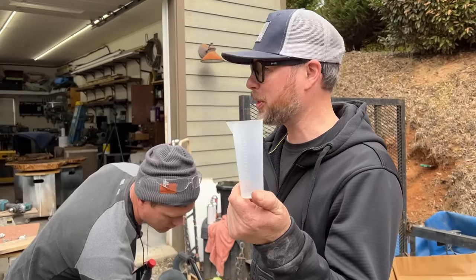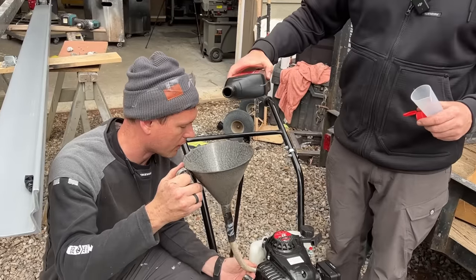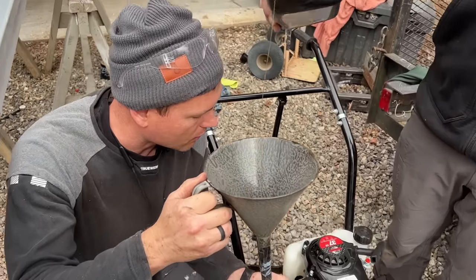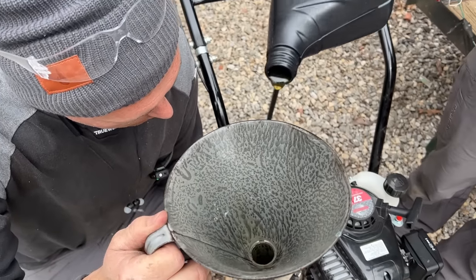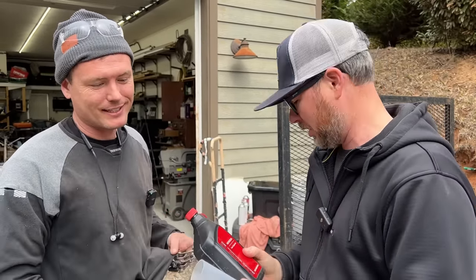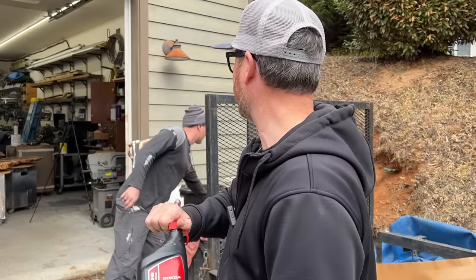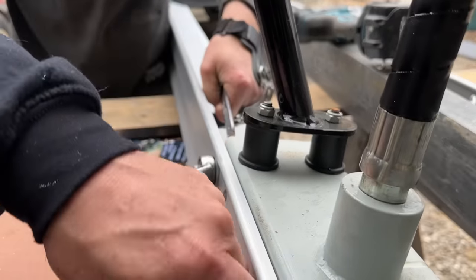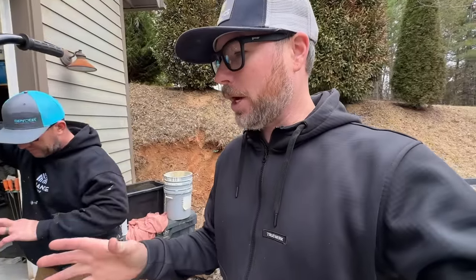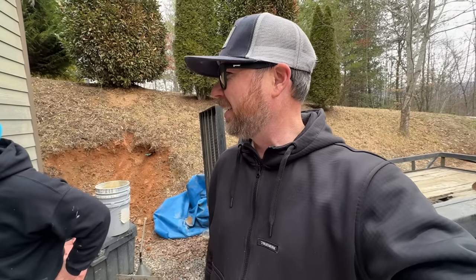There was a little filler cup in the crate, which is important: this is a four-stroke engine, not a two-stroke. With a two-stroke you put a fuel-oil mix in the tank and there's no separate crankcase oil. With a four-stroke, if you don't put oil in the crankcase, you're going to have serious problems. Disaster averted. The machine works by spinning an off-balance weight at the end of a drive shaft — like how your cell phone vibrates — except on a much larger scale with a gas engine.